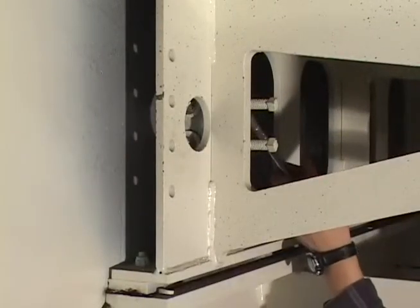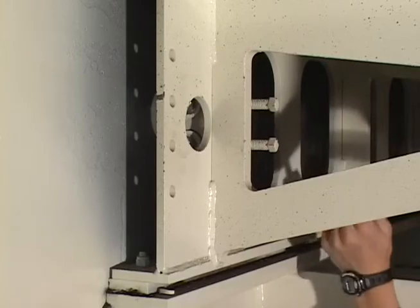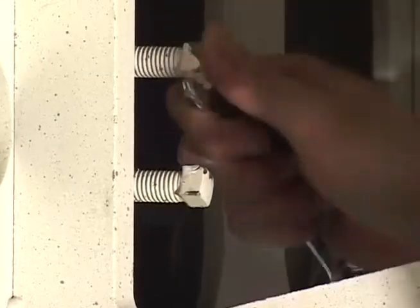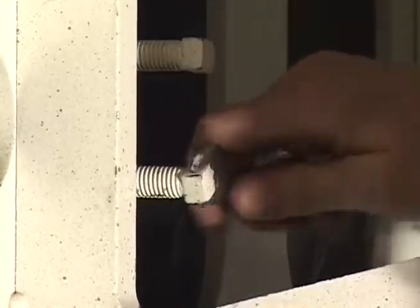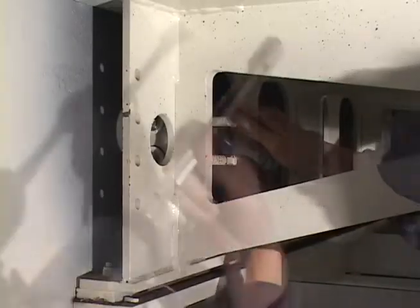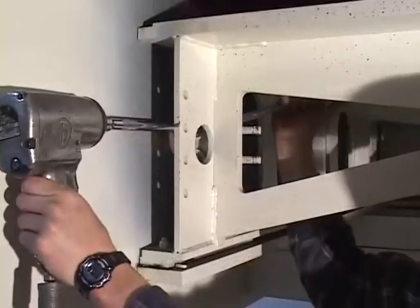On the side that measures farthest away from the frame, loosen the adjuster bolt three or four complete turns. Tighten the adjuster bolt on the opposite side of the ram until the spaces between both sides of the ram are equal. Tighten the jam nuts. Torque the slide aligner fastening bolts to 70 foot-pounds.